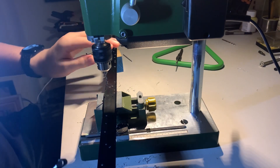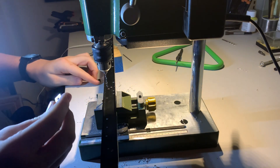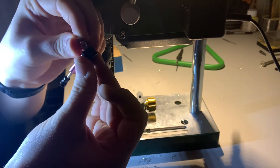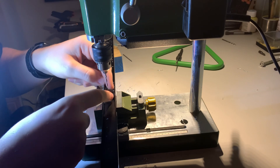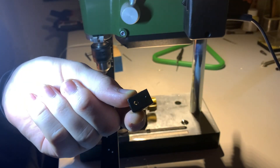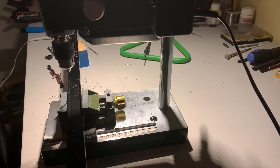I've done all the 2.5mm holes now. This is the 2mm drill bit — it only has four holes depending on what you've got, but there are definitely two at the back. It's used for when you've got your little shock cap: the shock absorber sits in there on the chassis rails, and that hole just holds it in place. Because they have to be at an angle and it's hard to get the screw in, they've put a little nipple on the back that helps keep it in place. All you do is drill straight through — it doesn't need any threads, it just needs to be big enough for that nipple to fit in.